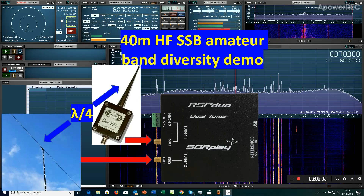The RSP Duo with its dual tuner and diversity software opens up the chance for some great experiments with various antennas, particularly down at HF where traditionally it's been pretty difficult to try this stuff out — particularly if you've got some limitations in terms of very conspicuous antennas. Like beam antennas, you can have a lot of fun with wires and vertical poles hidden in trees if you can exploit some of the spatial diversity.